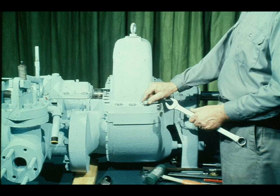The rings are stored in a protected area in the exact order in which they were installed in the packing housing. Use whatever method works best for you, but make sure the rings go back in the same grooves from which they were removed, and be very sure that the ring segments are assembled correctly. The next step is to remove the cap screws holding the casing cover to the case. There are also dowel pins that will have to be removed from the horizontal joint before the casing cover can be lifted off.